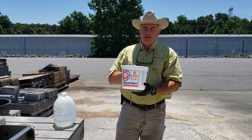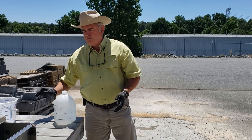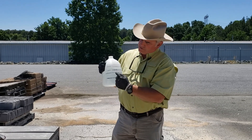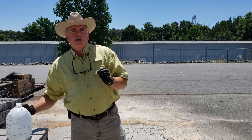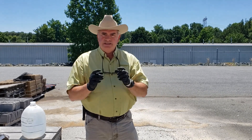You can use simple things such as a graduated measuring vessel — any bucket that's got tick marks on it is better than nothing. If you say you're in the field and that stuff's not around, throw a milk jug. This is what I teach in my classes: a one-gallon milk jug, and I've marked it off. There's a gallon at the top, but you can see two-and-a-half quarts here, three quarts here, and this water line is at three-and-a-half. This much water should have been all that we put in that mixer to make this bag mix the proper consistency. Concrete should be somewhat stiff — like oatmeal. For repair materials, we're more into pancake batter. But none of these mixes need superfluidity with water. You have to keep the water in relation to the cement — that's what's called water-cement ratio, and that's how we know what the strength is.